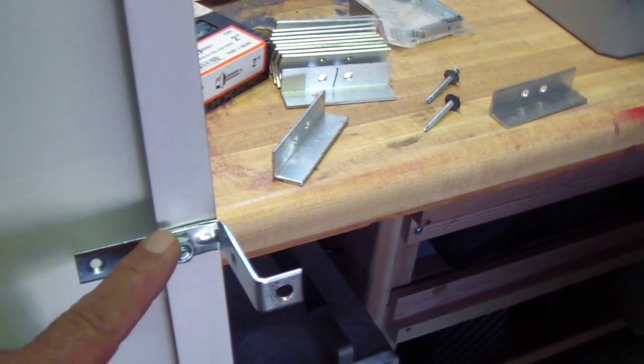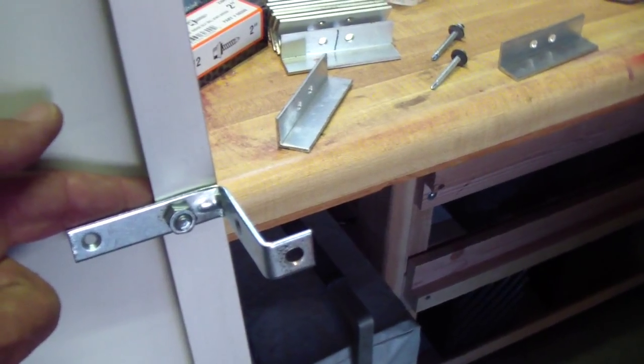Here's how I hooked up the Z-bar through the hole that is on the panel already. Basically, there's going to be one here and one on this hole here. I have the option of going to this hole and that hole, but I didn't like the long distance between the braces — that will give the panel flexibility in case of wind or vibration. With this hole and this hole, which is about three feet, it gives a solid rigid connection to the roof.